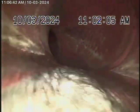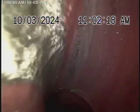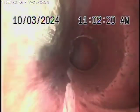We have a 6-inch clay lateral coming back from the street to the property line. This is in good condition. As you can see, it's nice and clean. There's a 4-inch clay pipe over here, also in good condition. And then it comes back to a plastic 4-inch pipe — ABS plastic or possibly a polyethylene pipe. We'll have a look when we come to the coupling.